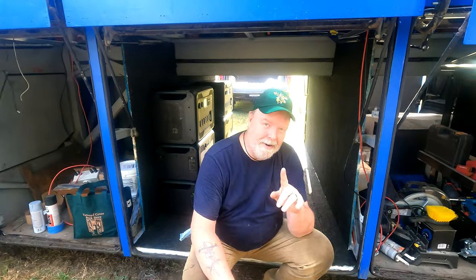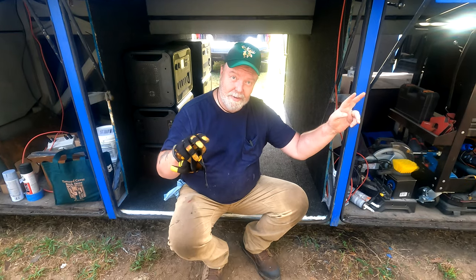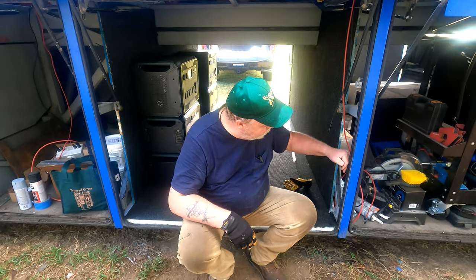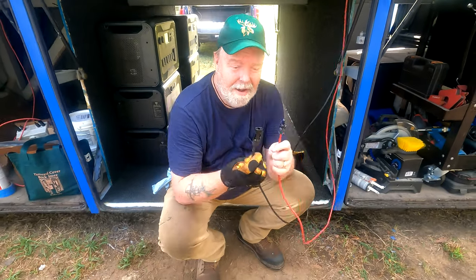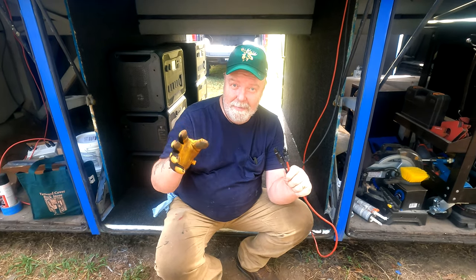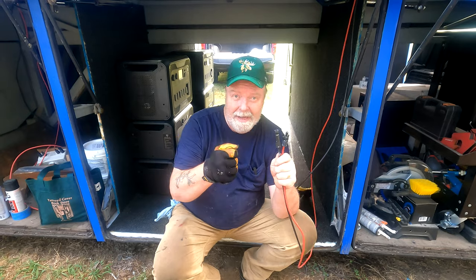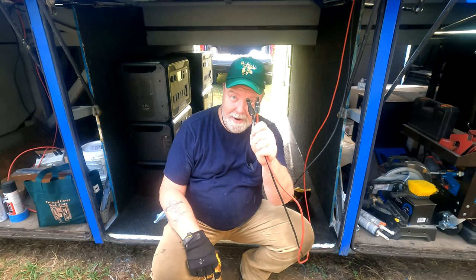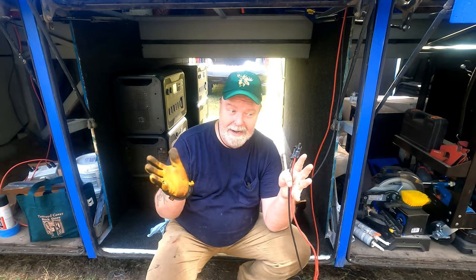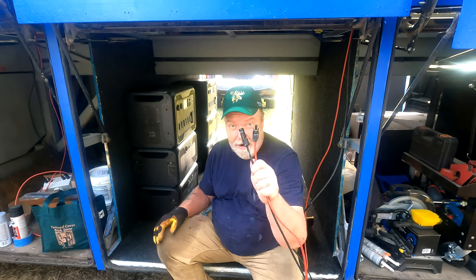You've already seen us installing our solar panels. We have our super array and our mini arrays. Mini arrays are two panels in series, and the super arrays are four panels — two in series each — in parallel, and we have two of those, so eight panels in total. Solar panels one through four all run in parallel to these two cables. We haven't fully wired up the other array yet, so we're going to do that now, and then we'll be able to plug them into what I call the Aniafi machine, and from there into the system.